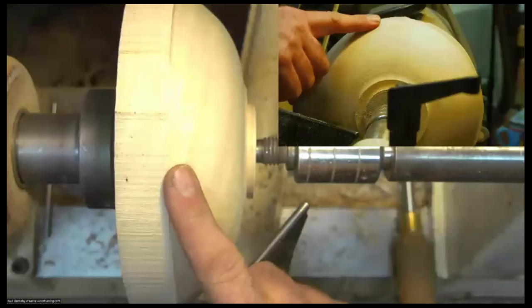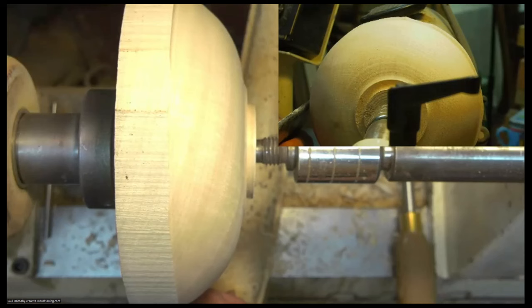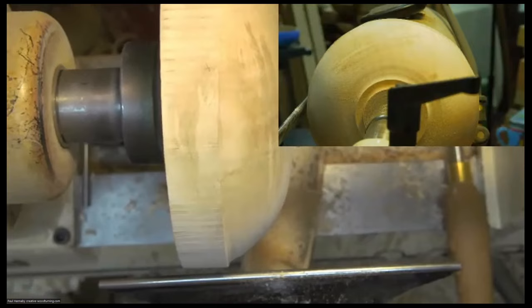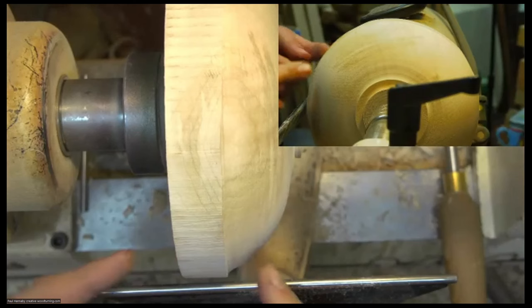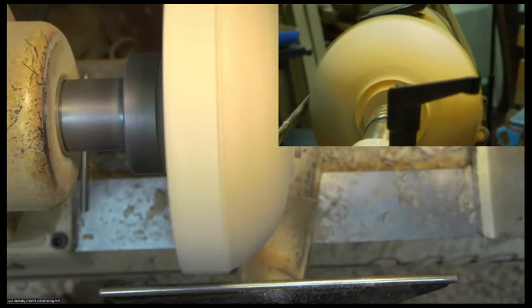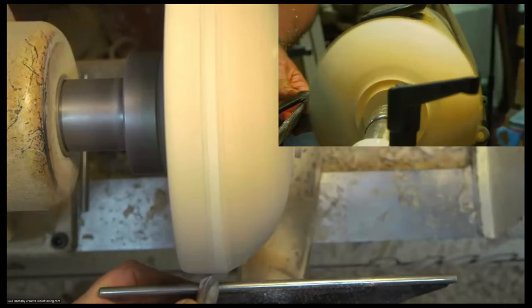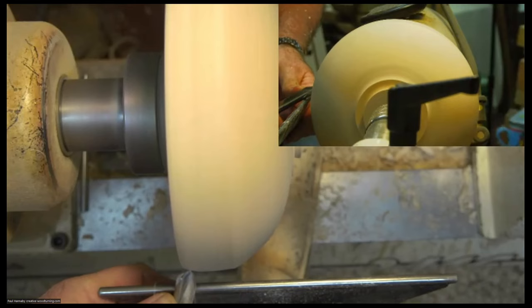A couple of cuts like that and hopefully you'll see a much cleaner surface — not perfect, but way better than those roughing cuts. That's taken out about 99% of the torn grain with just those few lighter cuts. Now I'm effectively up to the widest point, so rather than continue the cut upwards from the bottom I'll swing my rest around the other way. I'm now working on the top section — the reason I've moved the rest is I want to cut from the top down to do that upper part of the curve. It wasn't exactly circular from the bandsaw but that's easily fixed on the lathe.